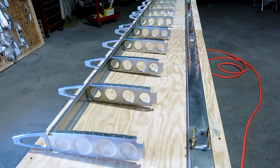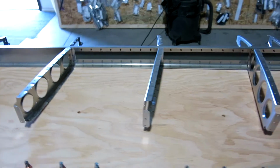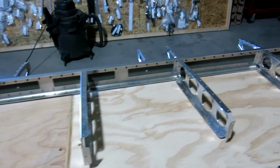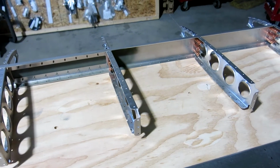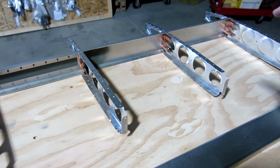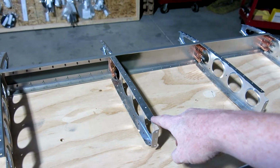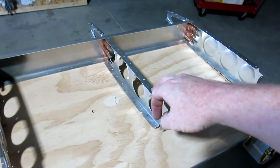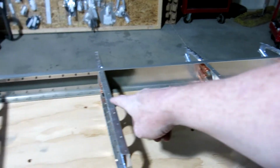It was going so good, and then we made a mistake. We riveted all these ribs into the front spar, and I got all the way down to this last one, and the thought occurred to me that it seemed like we were using the same rivets on everything across, which normally you don't do. Since we're going through thicker pieces here, that's the 41s, the 42s, we're putting the 42s in here, and this is a different rivet.